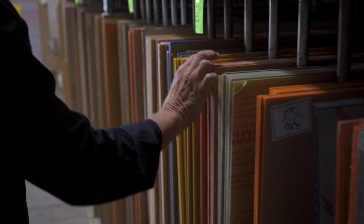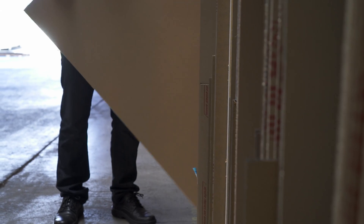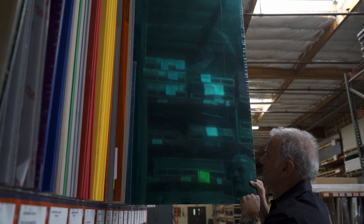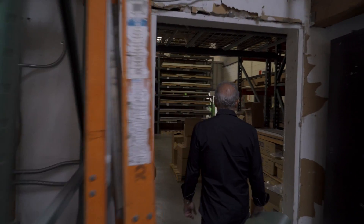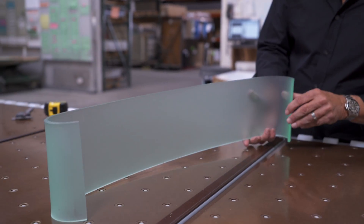Some of the angles in the panels — I'm just not quite sure how that would be done using glass. When you take a sheet of acrylic by itself before you do anything to it, it's not super rigid. But if you thermoform it into a three-dimensional shape, just like a piece of paper, it picks up rigidity.